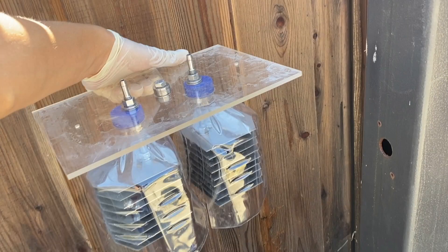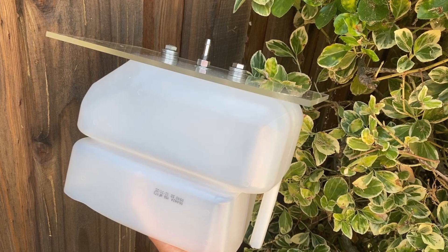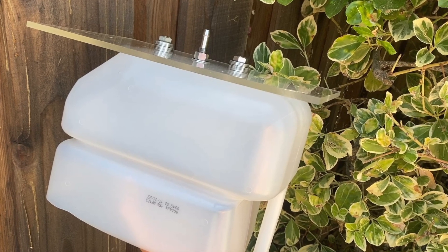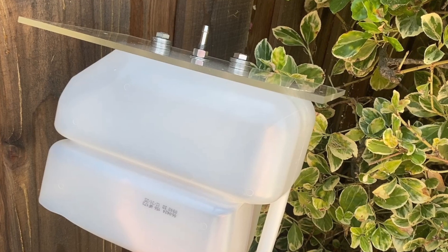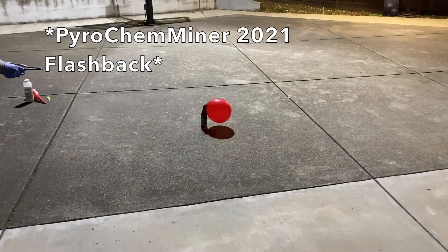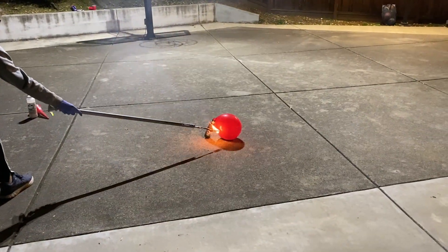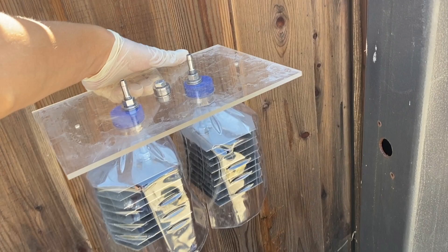Even with the trial 2 test, no gas was collected from the bubbler cups. I still think the gas is leaking out by the caps of the containers — the interface between the nozzle, lid, and bottle cap with all the washers is too complicated, allowing gas to escape. In a future video I'll try to solve the sealing issue by removing the lid entirely and having the gas collected directly from the plastic container — either through a balloon stretched over the neck or a tube permanently attached with a good seal at the cap. If these ideas don't work, there's something really wrong with this design and I'm going to need some help, so please drop your ideas in the comments below.